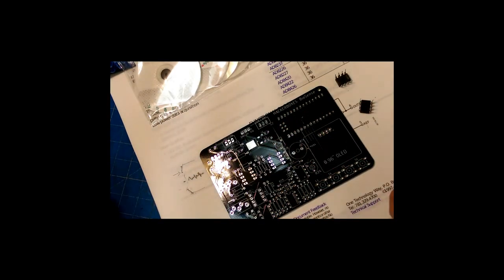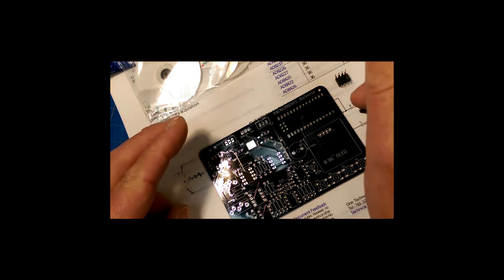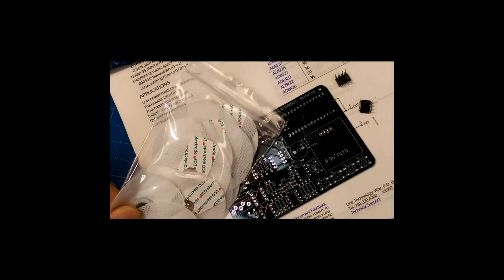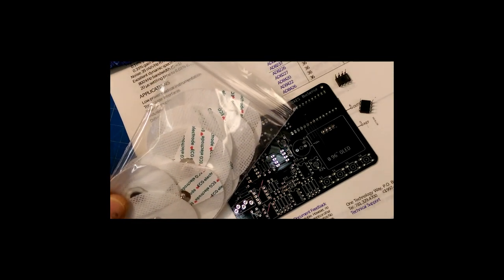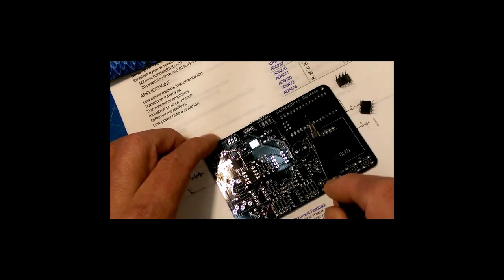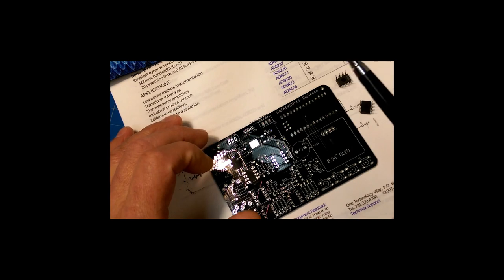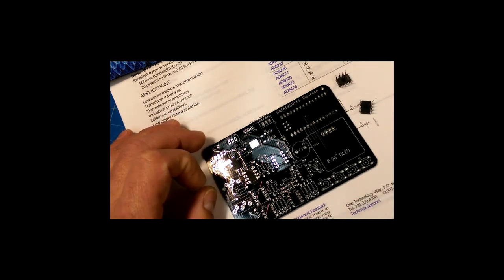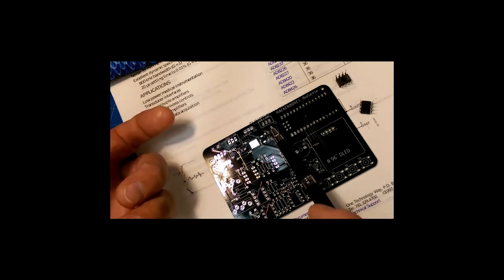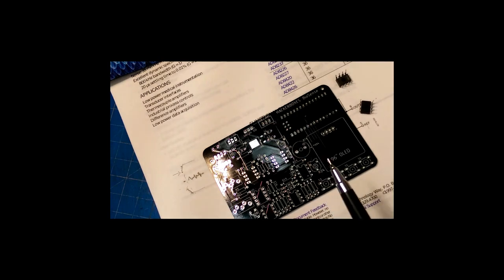or to the computer. And then if you plug the computer into the wall, there is a theoretical connection between the wall, line voltage coming out of the wall, and the subject under test. And that should be avoided at all costs. So the USB battery switch will disconnect the lines that connect the microcontroller to the amplifier stages, so that there is no contact between line and subject. Now that's a pretty sketchy system if you're asking me, because there's no physical interconnects that prevent you from plugging it in, but at least it's something. So let's start soldering.